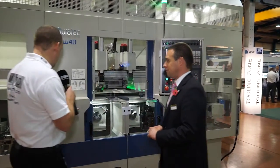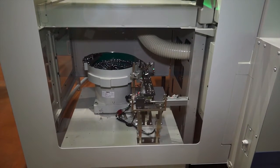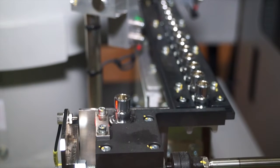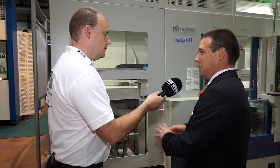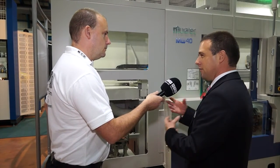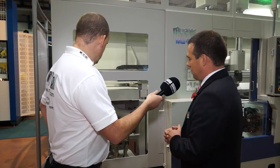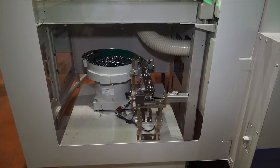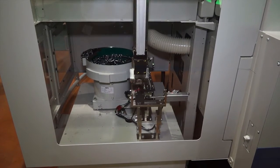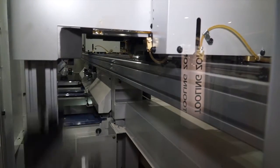Let's look at the loading. What are we doing here? One of the things that Murata do is they're very good at integrating some form of automatic loading. It's very rare that we have just the machine dropping on the floor working as a two axis lathe — there's always some level of integration. On the system we have here, we have a bowl hopper which is randomly picking parts out in the correct orientation, delivering them down the part chute for the robot to then pick up. You've then got an OP10, a turnover station, OP20, and then we're feeding out the other end with a conveyor.